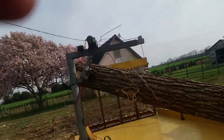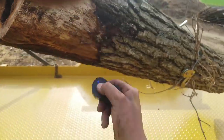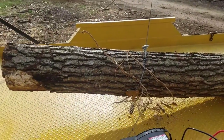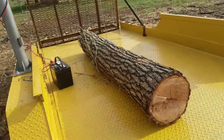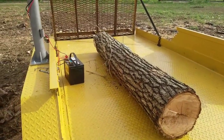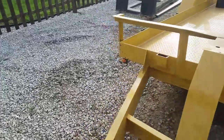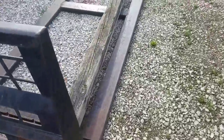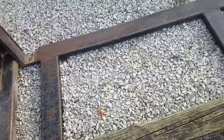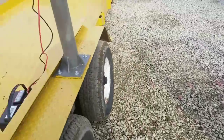Definitely a two-hand job though. There you go — an eight-foot by one-foot log. One end is a little rotten but the side isn't. It's doing it easily. I also left a snatch block on there in case I want to skid some wood. This should be a pretty good torture test — a set of pallet forks with a big attachment on the front. This has got to be pretty heavy. I want to see if it picks it up — if this mount fails, I want it to fail here rather than on a job site.